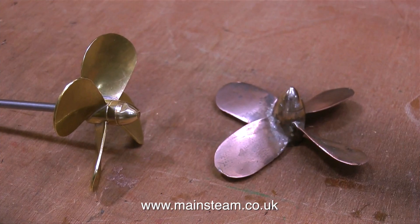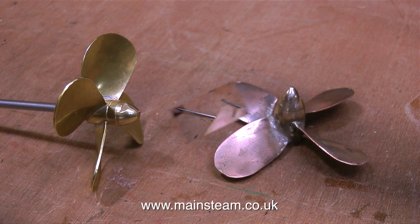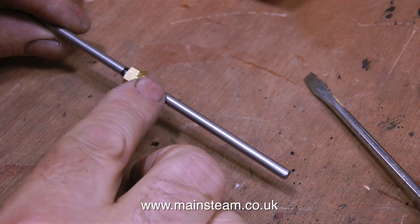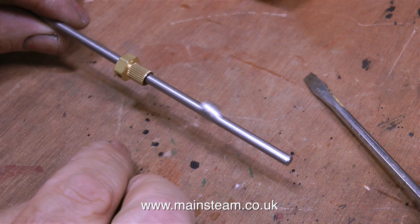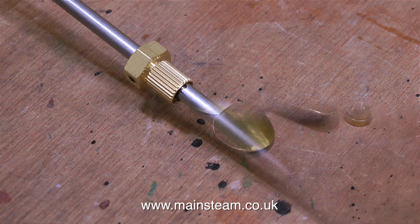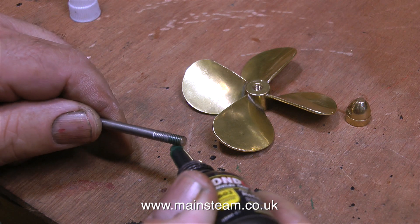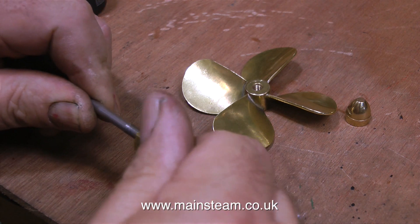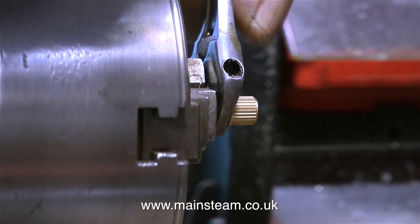On the right-hand side of the picture is the original brass propeller with copper blades, but I think the one on the left is going to be much better. I temporarily fitted the propeller shaft into the boat and marked its length with a felt tip pen. This is not the splined union I'm going to be using — I'm going to cut the prop shaft on the second mark. The propeller will be fitted to the outer part of the shaft using the lock nut.